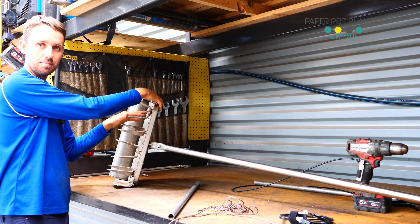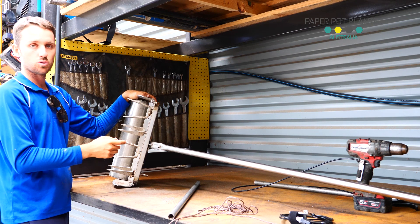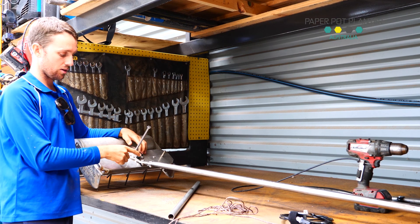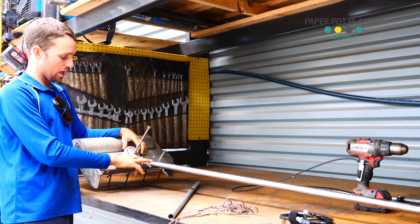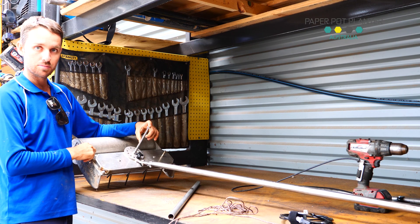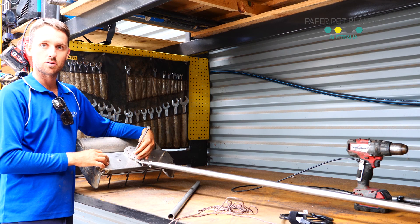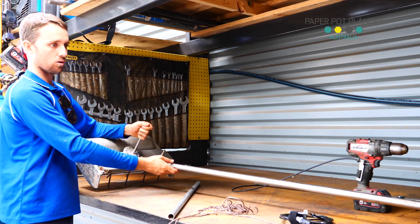So there are your M6 bolts with your large washers. This whole part here will be assembled together. What you'll want to do next is install your handle. With the original handle you'll have a crossbar-type configuration — yours will possibly be welded in as opposed to bolted, so it'll come as one piece already. What you'll need to do is firstly install your M10 long bolt with a nut into your mainframe, and then your hand knob — you can select whichever hole you want to put it into and tighten that up, and your handle will be in place.